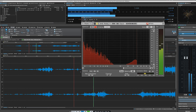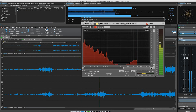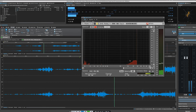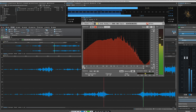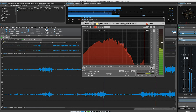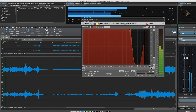I just wanted to point out that in both of these files we can see a little bit of noise extending from 30K all the way up to 50K. This is just inherent system noise - this isn't really part of what the KM84s are picking up, just something inherent in the system. Now we're going to zoom out so we can get a closer look at the frequency response of these KM84s. We can see quite an abrupt cutoff from about 15K all the way up to 20K. And if we zoom in vertically all the way down to around minus 110 dB, we're not seeing much activity above 20K.